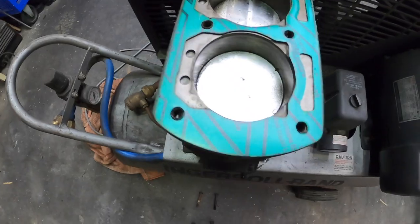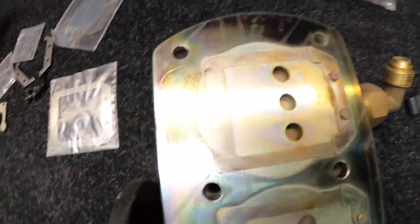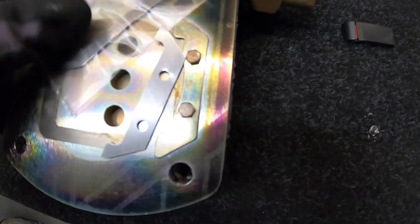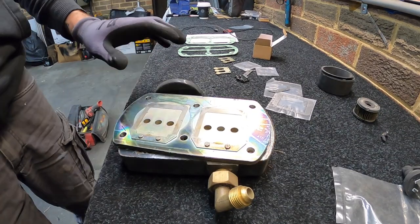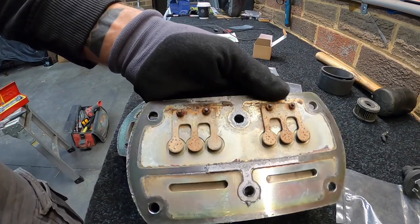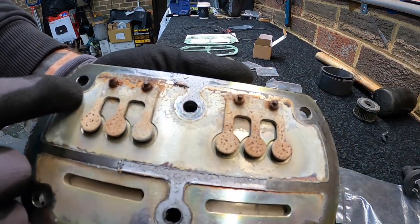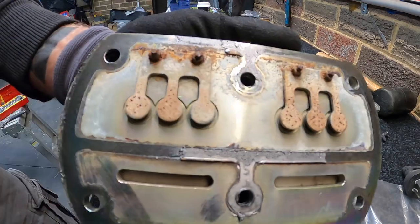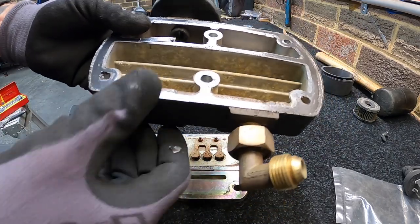So let's get this pulled apart. I'll rip this valve cover off and we'll see what's inside there. I'll give that a little bit of a clean out. A little bit of crap down on the top of the pistons there. The gasket still looks pretty good. So this is our plate — there's obviously the back side of those, there's the top little ring, and the fingers will be on the top of that. She does look a little bit tired. A bit of moisture's got up in there. I'll pull these fingers out now and then give this a good clean up.